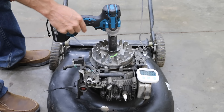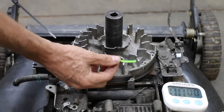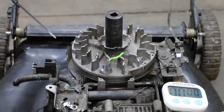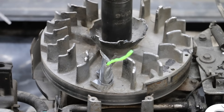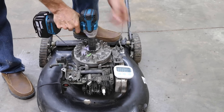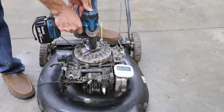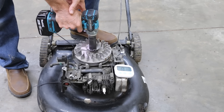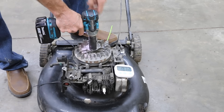The next test demonstrates the ability of both impact wrenches to remove a nut from a bolt with galled or cross-threaded conditions. We tracked total rotations over a 30-second test using a green rope as a counter, with an engine brake applied and the engine in a spark-plug position to create compression resistance. Cousin Eddie managed two and three-quarter rotations overcoming the engine brake and compression. The Makita achieved five and three-quarter rotations — very close to twice as much work.